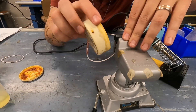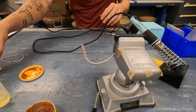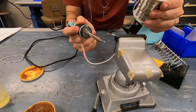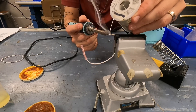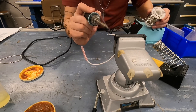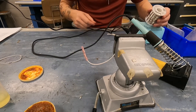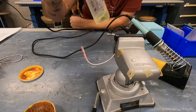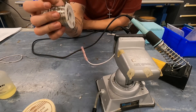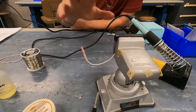Quick segue — this is the piece I broke earlier by tugging too hard on it. If I take this flux paste and get some on the end of this wire, then melt solder and put it in, it's going to boil all that flux out and draw all that solder up into the wire. But the problem is I'll have too much flux in that joint when I'm done. You should only be using flux — paste or liquid — when the solder you're using is non-flux-core, just like in welding you can use flux core wire or regular wire with an inert gas like argon.